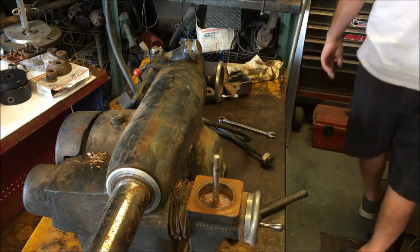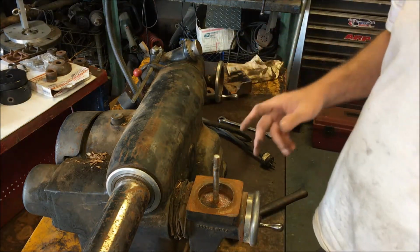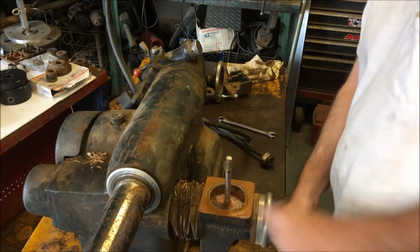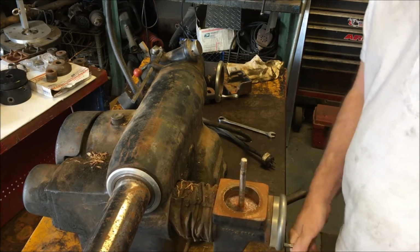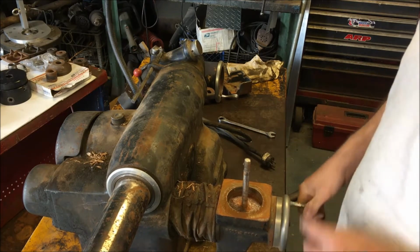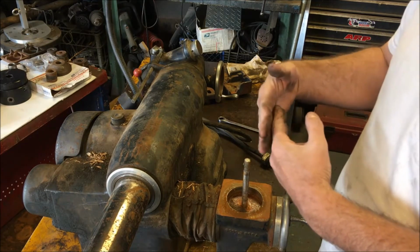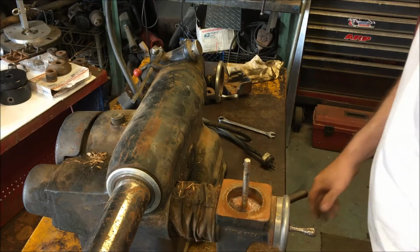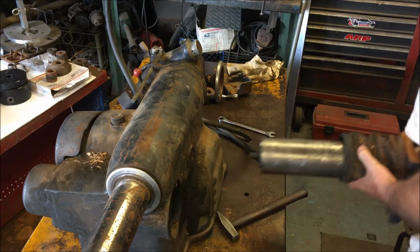1 inch. On a disc machine, a disc and drum combination machine, it has the gearbox attached on that same thread. The feed screw is pretty much the same. There are some differences in what they did over here on this end, where they put the thrust shoulder on the shaft, but the rest of the screw is pretty much exactly the same. They kept grease in it. That's a good sign.